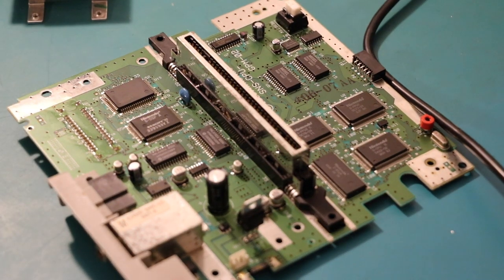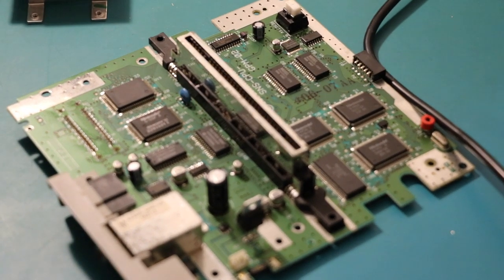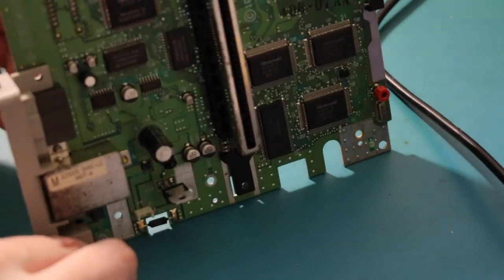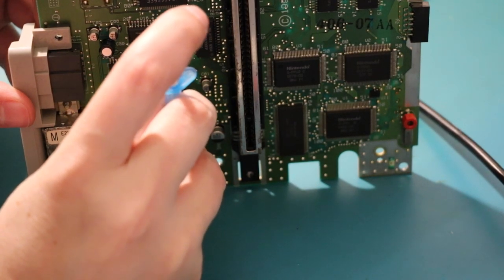What else did I need? Thermal paste. I actually just found this in the drawer a bit earlier this afternoon. So you don't need much of it. In fact, you probably don't really need any. If you don't have any, don't cry. I mean, it's got a space for it, so pop a little bit on if you've got it.